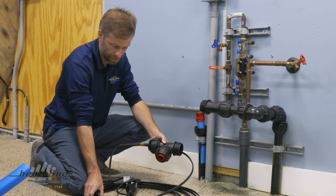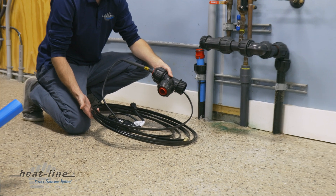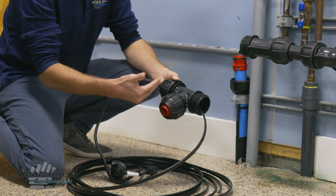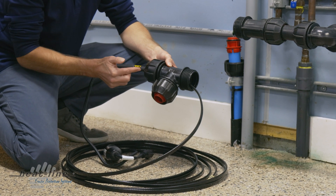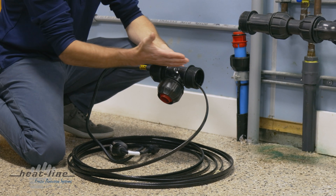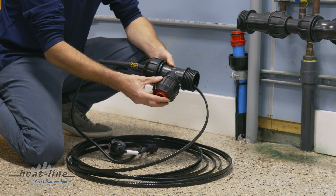This particular retro line system is a short length — it's a 30-footer with the T-configuration. We actually have it in a 90-degree-to-water format. The standard configuration normally has the electrical connection coming off the branch, which provides a straight-through water flow. With the 90-degree-to-water format, we have the electrical connection coming off the side of the T, giving us a 90-degree water flow.